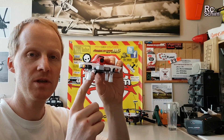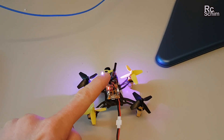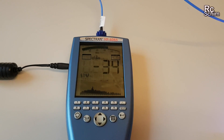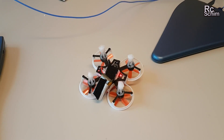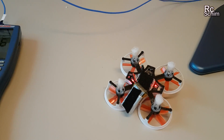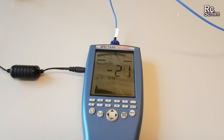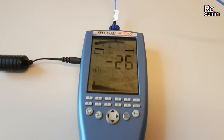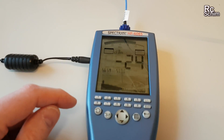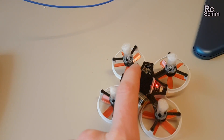It comes pre-configured at 200mW, I'm quite sure, because with the antenna outside I can fly in my whole house. Comparing this to the FatShark at 25mW — one hand away from the antenna gives me around 33-34 on channel 5740. With the antenna routed outwards I get 24 to 20, with changing readings. On this low channel I'm getting around 56 to 60. So it's definitely more than 25mW and it's a good idea to route the antenna outwards — I could fly around the house quite nicely with these settings.